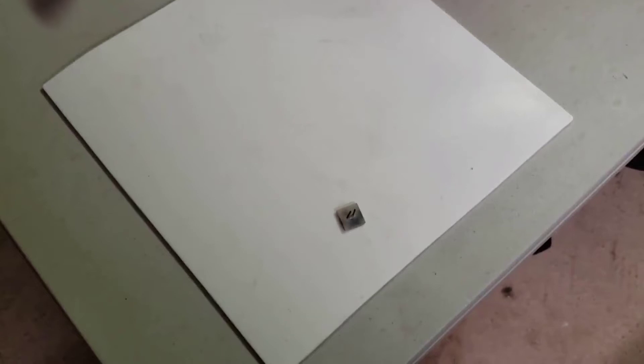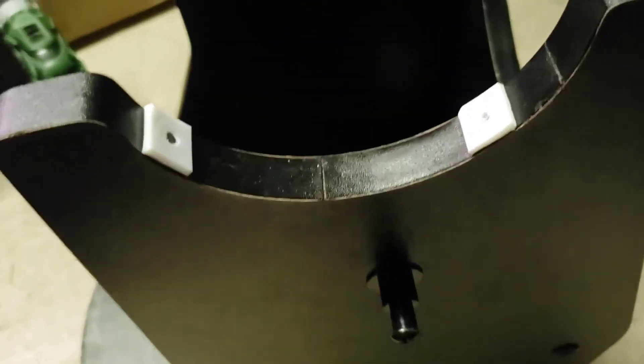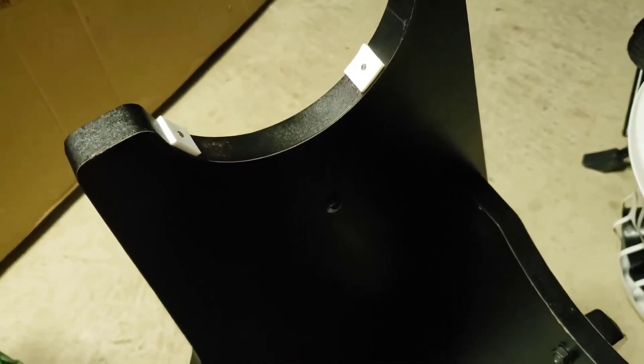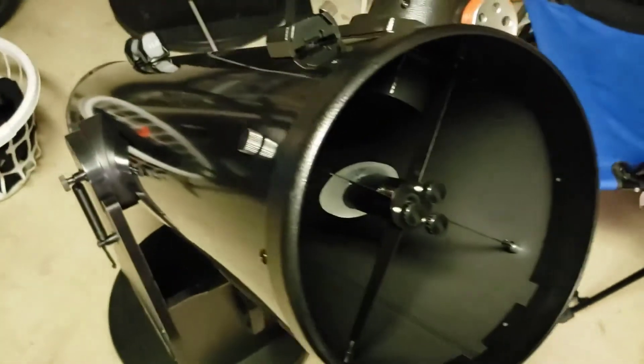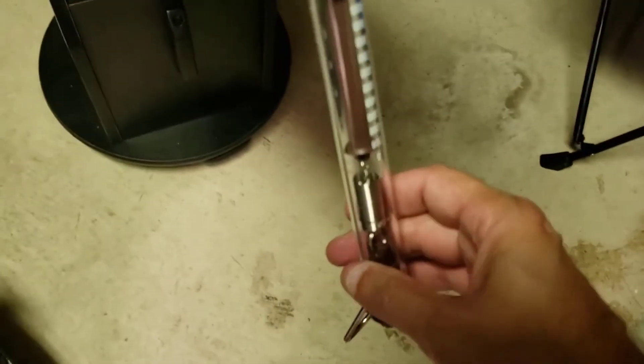I'm just going to cut four of those out. We've installed the Teflon pads to replace the other plastic, which was not very slippery. We're going to put the tube back on and see if we can eliminate the stiction while hopefully maintaining some of the friction — we'll see if that's possible. Here's the scope. We have it on with the springs just like before. We've got our little scale and we're going to pull on it while looking at the measurements.